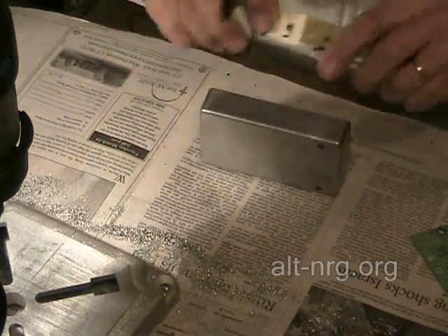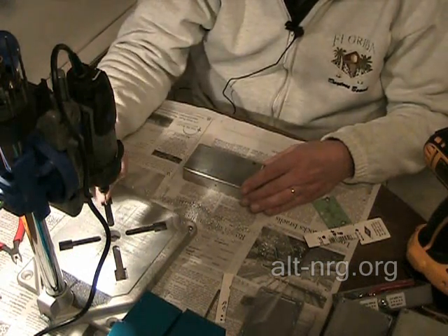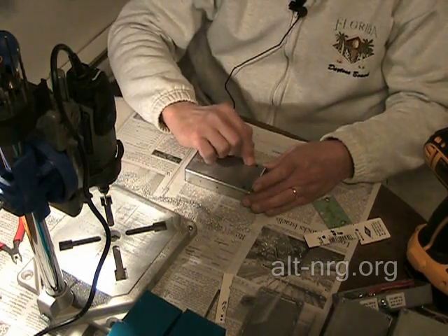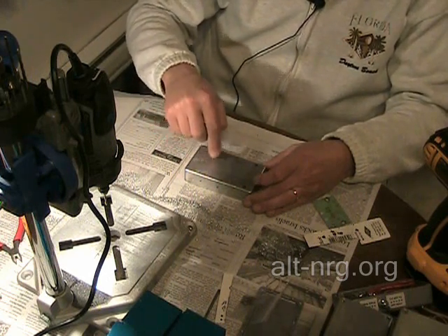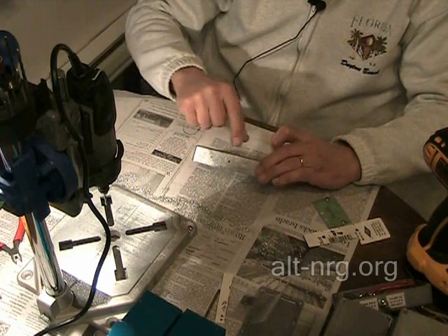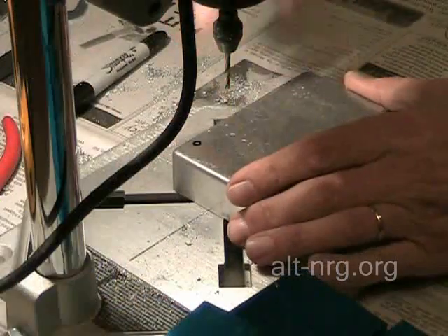On this side is my positive. In my little Dremel drill press I have a 7/64 drill bit. I use this for the heat sink holes which then get tapped with a 6-32 thread. I also use it as the through hole for the two mounting screws for the PC board — 4-40 screws slip right through a 7/64 hole. I also use it as pilot holes through the top of the case, for fan leads, and for terminals on either side of the box. So the 7/64 drill bit drills every hole in the box — six, seven, eight, nine holes altogether. Some are pilot holes and some are the finished holes.